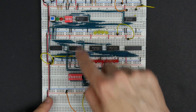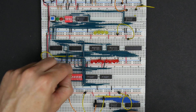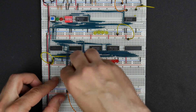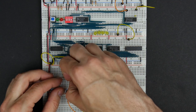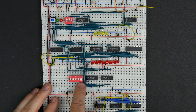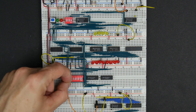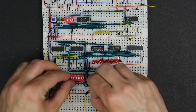Just like we did up here, because it's unintuitive for the switch to be down meaning high and up meaning zero, I'm going to flip this switch upside down. That way, when the switches are down they're on, and when we flip the switch up the switch turns off. When it's off it's not connected to ground, which means it's a one. When it's on — when it's down — it is connected to ground and it's a zero. I'll go ahead and connect the rest of these.